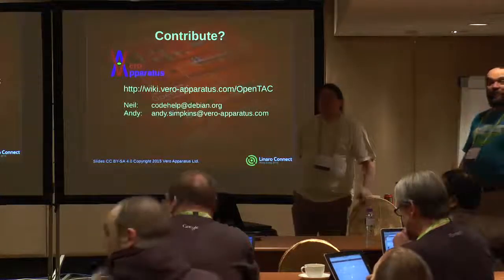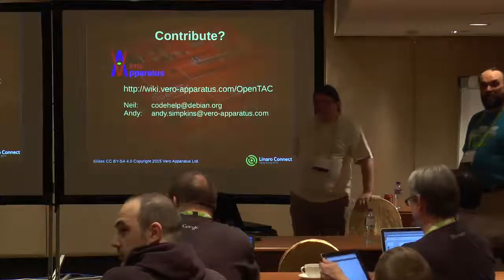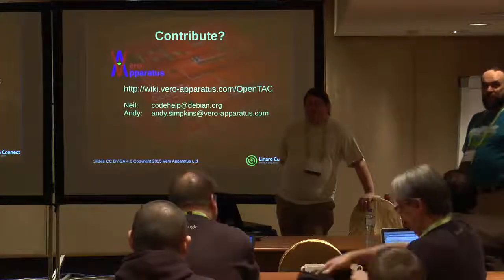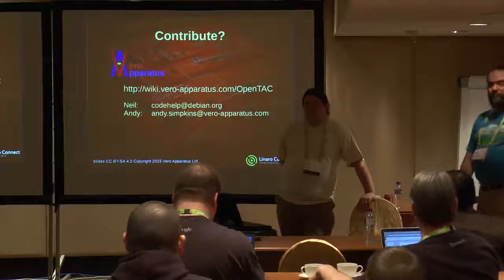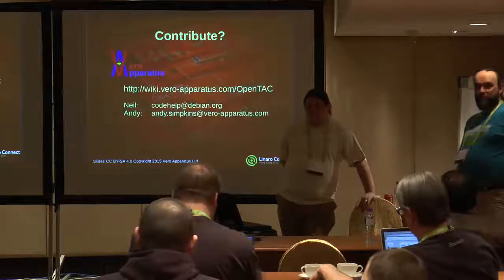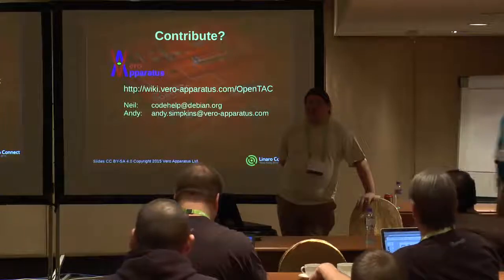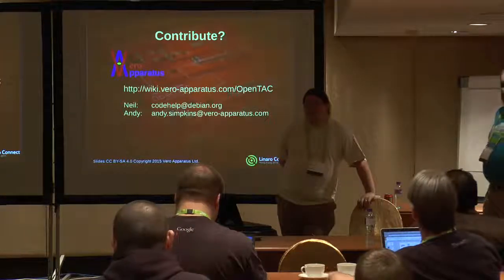Sorry, I came a little bit late, but the main idea is you have a BeagleBone Black that will give you an HTTP server and socket interface, and by sending commands to the BeagleBone Black, you control the serial port, the power, and the USB power, USB data, 2A ports to boards, and also monitor what the power usage is, and effectively provide a software definable fuse.